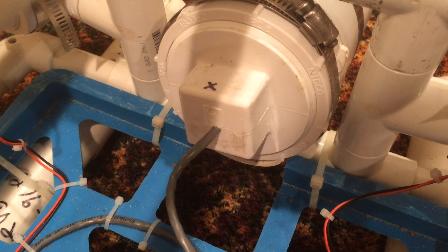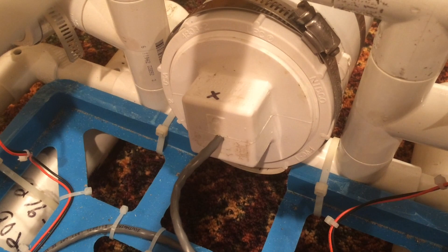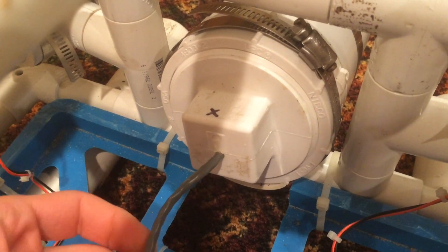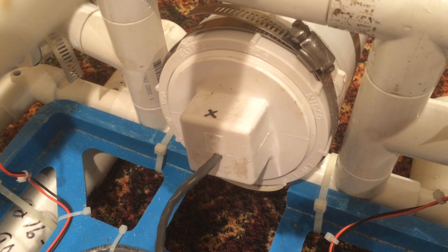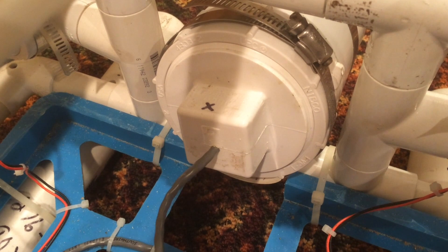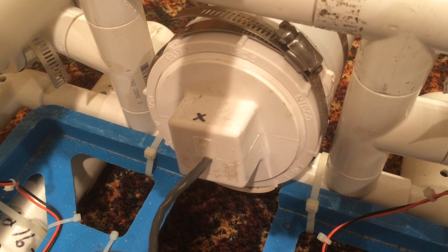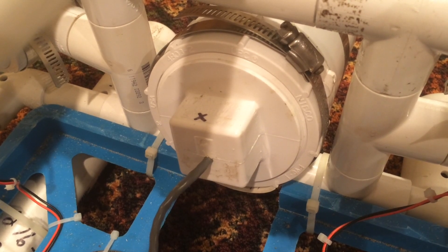I'll post a link in the description to instructions on how to waterproof wire holes in your PVC pipe. I'm using an ethernet cable for the camera, though I'd recommend coaxial cable — I just couldn't find a cable long enough. The camera must have its own power supply. If connected to the same supply as the motors, the motors will eat all the current and the screen will go black whenever you drive.